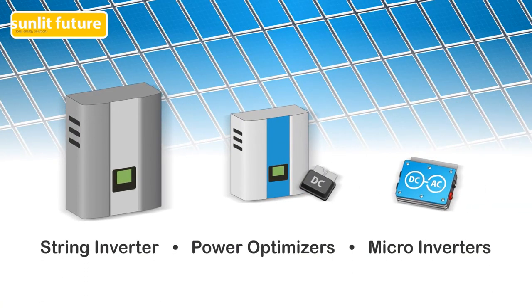Overall, systems with MLPEs are more efficient and will produce more power than a similar system with a traditional string inverter. They are still more expensive than a traditional system, but prices are falling as their popularity grows. MLPEs have better durability, a longer lifespan, and they come with a longer warranty period.